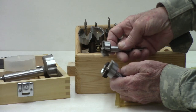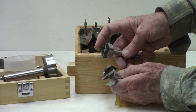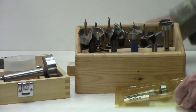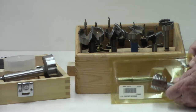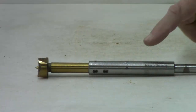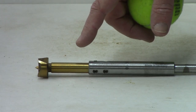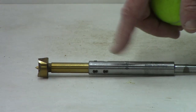Get one with teeth — especially if you're doing pepper mills, you'll want one with teeth where you're doing a lot of end grain. What do I use it most for? Drilling larger holes. Also, when I'm making threaded glue blocks and I need a very precise hole cut in the wood for tapping. A handy accessory for drilling larger holes — for example, if you're drilling very long pepper mills, even though you're drilling from both directions, you'll need an extension.